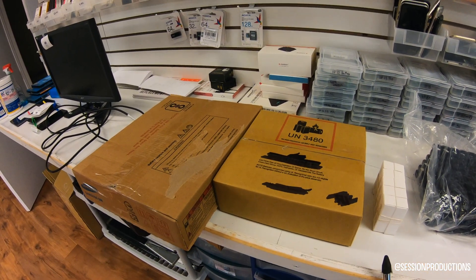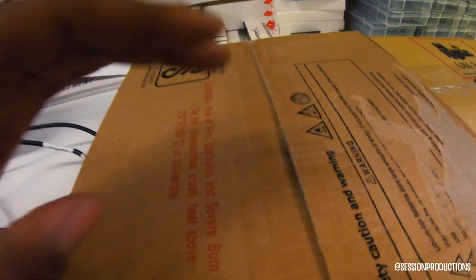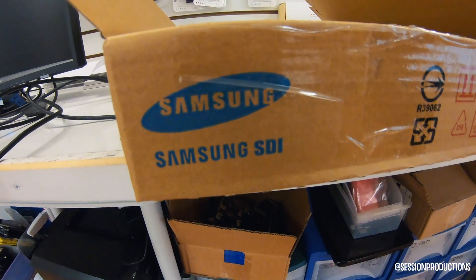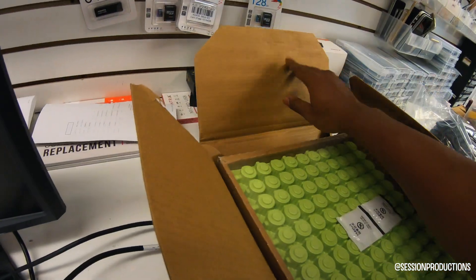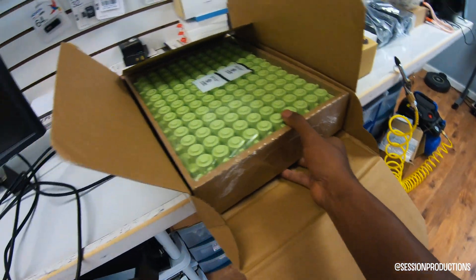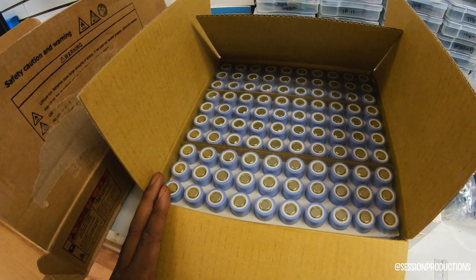In this video I used Samsung 4,000 milliamp hour batteries — they're 21700 series, so they're pretty big. I'm actually putting 20 cells in series to make one 72 volt line. This video is going to be a little different because I don't show everything. If you wanted to see everything, you should check out my 48 volt battery build because it goes through every part of the battery making process.